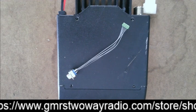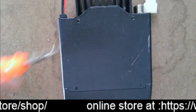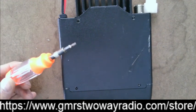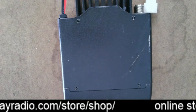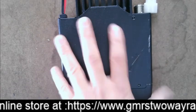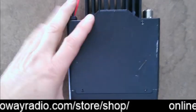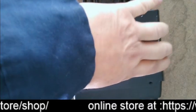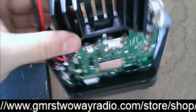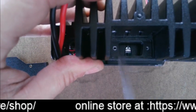Now let's get to how you install this — it's really simple. You're going to need a Torx T8 star bit, which will fit the four screws in the radio. Note that we're working on the side that does not have the speaker. Once you remove the four screws, take the cover off. Whether your radio is new or used, there's probably going to be a sticker over the hole — take a small screwdriver and pry off the sticker to access that opening.